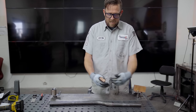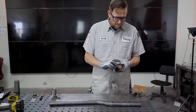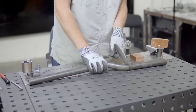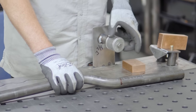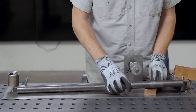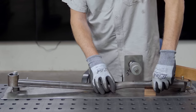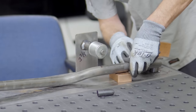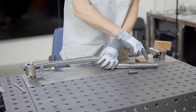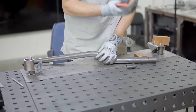One thing I took away from my drawing is making sure I had common sizes when working with things. The distance from the bottom of the tube to the actual fixture is exactly an inch. So this is a copper chill bar from Weld Metals Online — it makes for a great spacer. It's a 1-2-3 block. I also marked the position on the tube from my drawing of where I want my vertical to take off and attach to the bushing housing. If I place this here and get that alignment where the mark meets the edge of the bushing housing, then I put it flat and clock it, and mark out the angles and positions I need to cut.